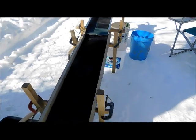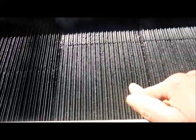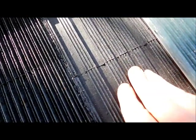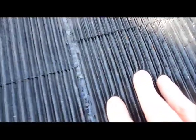So I got my 8-foot sluice, and in the sluice, let's start at the top. This is the mini high-low V-mat silicone mat from that mold. Then it's going to the regular 1/8 inch high-low V-mat mold. These are 1/16 of an inch. Then we're coming down here to the next 4-foot section. I did stick a drop riffle V-mat in here just to kind of break up the water flow. Then we went to the mega 1/4 inch high-low V-mats here on the bottom, and then just one filler at the bottom there.